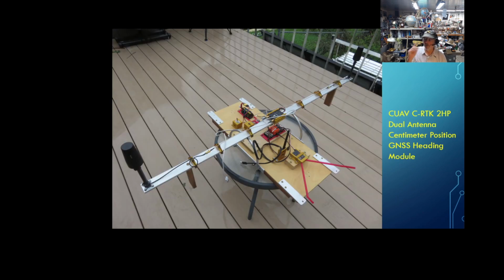Now I made the top removable, and I really like that, because my motor control unit, my Cytron, says in its documentation not to push the wheels with the power off. That will generate a spike, and you could potentially damage that controller. So I made the top completely removable, and all I have to do is connect a couple lines from the mains back here on the motor controller at this stage anyway. That way I can just take it on my deck and try to figure out how everything works. And it's been a lot of figuring. This is an earlier picture. I've been through 3 GPS systems.